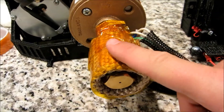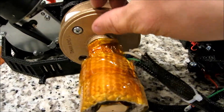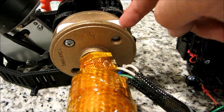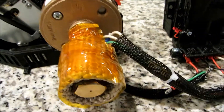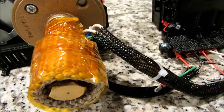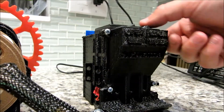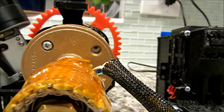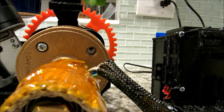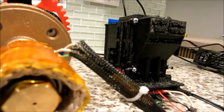What's going to happen is as this unit heats up, the heat's going to travel back and start to heat up the pipe and this flange a bit. Because we have this insulation here, it's not going to travel back to the flange too much, but all of this acts like a heat reservoir, and that heat reservoir is necessary. Once you start turning on the extruder and the plastic starts pumping through and coming out, it's going to start cooling down again — you need that heat reservoir to keep the heat in there. We want to plug the DC motor in now. We're going to come back after this unit has heated up.